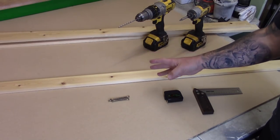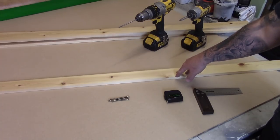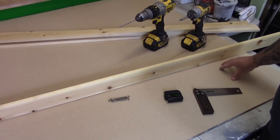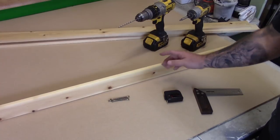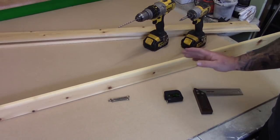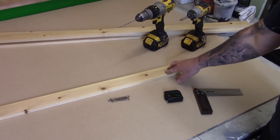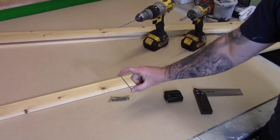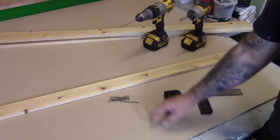You'll need a minimum of 4 pieces. I recommend getting them pre-cut. Get them cut to around 1250 to 1300mm — the width of the board is 1220mm, plus the depth of your skirting for the overhang, which is about 12mm. So if you get it cut at 1240mm, it'll be slightly over and you can trim it down once your sides are on.